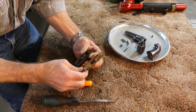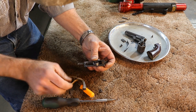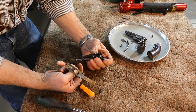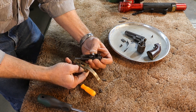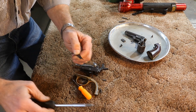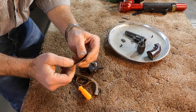There's where it sat in this groove or notch in the trigger guard here. So we've got a V-spring that sits between the frame and that notch there and gets compressed by the trigger guard. Looks like we're going to make a V-spring. I don't like V-springs, but sometimes you just don't have a choice. We also found when we took this thing apart that this isn't an original main spring. Somebody's made a homemade one and it's missing one of the ears where it hooks into the stirrup. So we're going to have to either make or come up with a main spring as well. We've got work cut out for us with some spring making coming up.